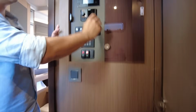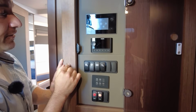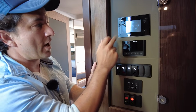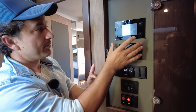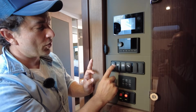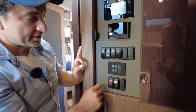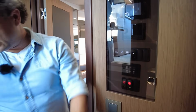And then as we make our way forward, you've actually got your control panel just here. So that ship's control system is a really neat Wellcraft feature, which will show you up on the display. That'll actually let you cycle through battery management, power management, genset on and off, lights on and off, and it's all in a quite easy to use display up at the helm. And we've got our Fusion just here. We've got some more systems like pressure water, power for the navigation, and raw water as well. This is all our batteries on and off just here, and then that is also power for the genset just there.